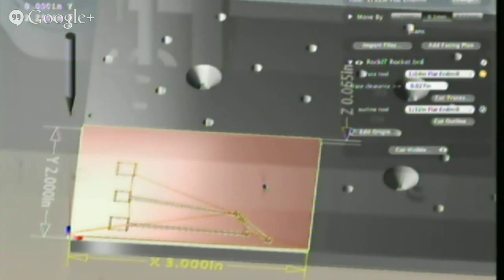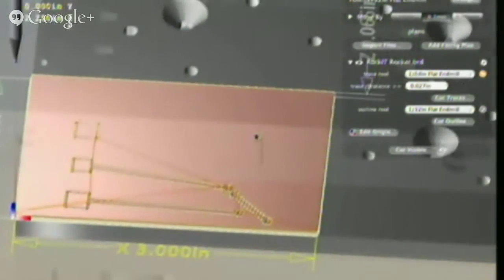Another app that you can use to make board files is circuits.io, or what's now called 123D Circuits, which was bought up by Autodesk. It's just a simple website where you can design schematics and circuit boards, and we should be able to see those as well. I think you said in one of your announcements that at one point it was only going to support Eagle CAD. So now it's Eagle, it's Gerber, and it supports the more machinist format, G-code, that comes from other CAM software. So you can use anything that can export G-code. If you use VCarve or HSMWorks or really fancy Rhino CAM or whatever, you can load that into Othermill.